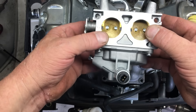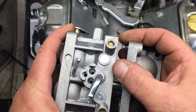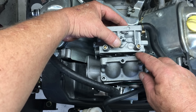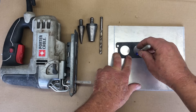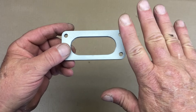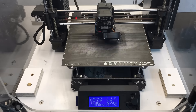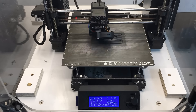This is going to be a simple experiment, and due to the limited space and to avoid making things very complex, I'm suggesting we construct a spacer that will go between the carburetor and the manifold. This spacer will allow cross-flow between the two sides of the carburetor. It ain't going to be perfect, but based on the results we can determine if this is the right direction to go. Rather than grab a chunk of aluminum, I'm going to 3D print the part we need from ASA plastic. It took me 25 minutes to design this part in Tinkercad, and almost two hours for the robot to print it.